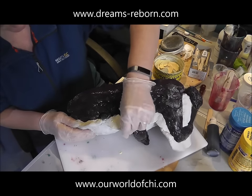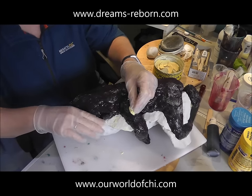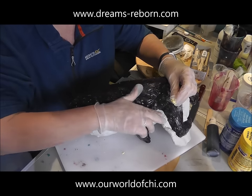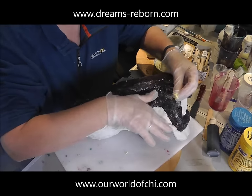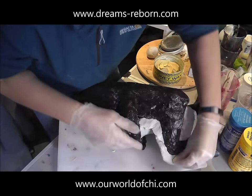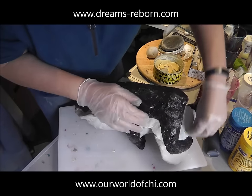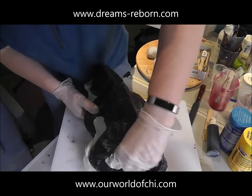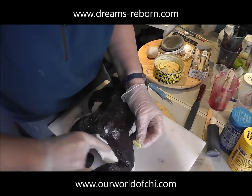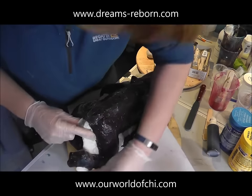edge of the mother mould, just so that when the next piece goes up against it, there will be this layer of wax between it, and it'll come away nicely. I find it's the best thing. Vaseline doesn't work, I don't think, quite as well. In fact, sometimes I think Vaseline makes it worse. So I'm just going to rub it over all the edges that the next bit might touch. All these flat bits that are left. Place the next piece of mother mould up against, and here.